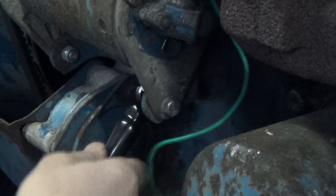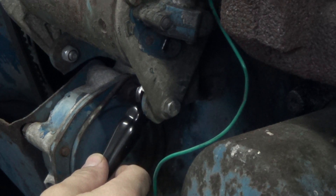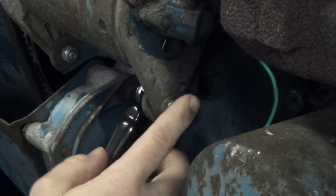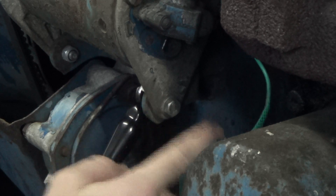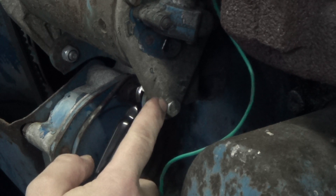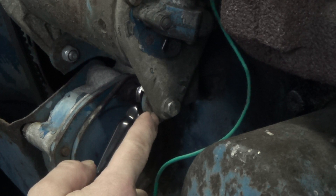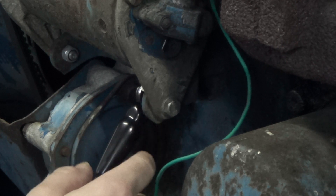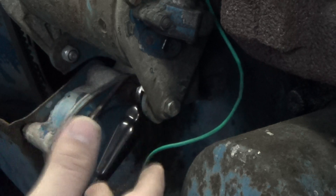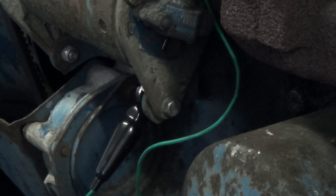You can see here I've got the negative of the meter on the dynamo. That can be a problem also if there are dirty contacts to the chassis of the tractor from the dynamo. It contains some rust and things, so probably I'm going to clean all that, but first I'm going to see if it works at all.